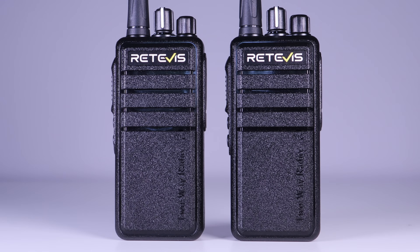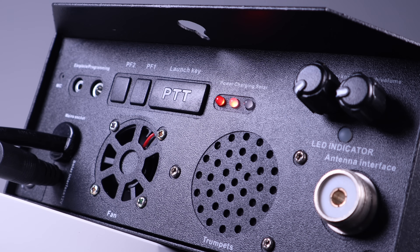The final thing to do is head out and do a couple of test transmissions. I'll mount the repeater in the attic on my Diamond V3000 antenna and leave a handset down in the shack. I'll then drive a couple of miles away and do a test back to base. In theory, the handset in the shack shouldn't be able to receive my call directly, and the repeater in the attic will feed the call to it instead.